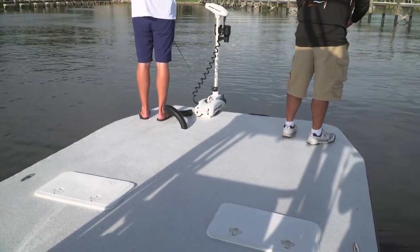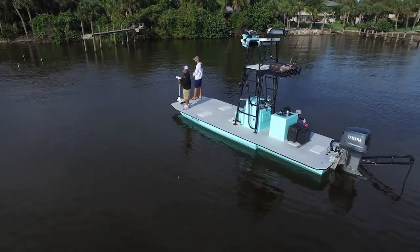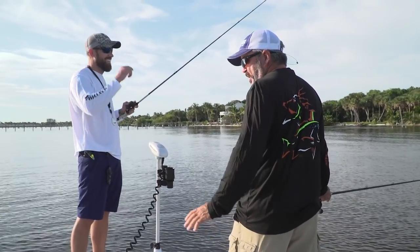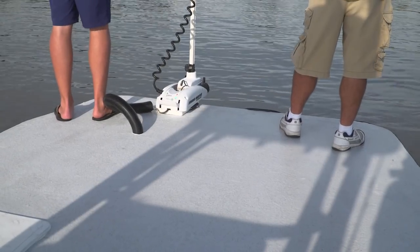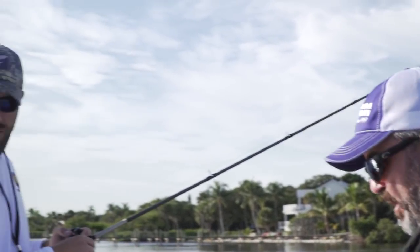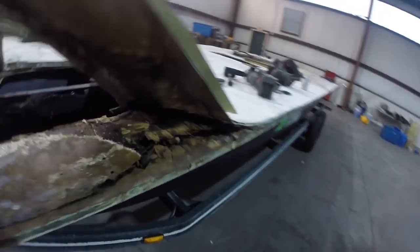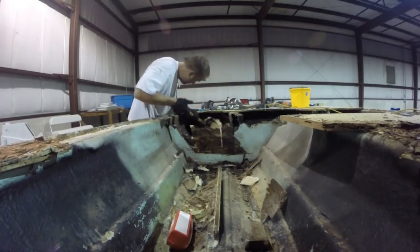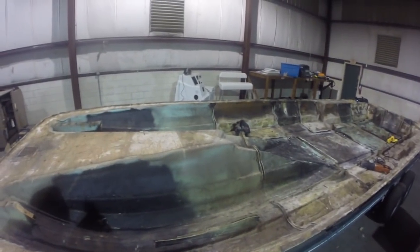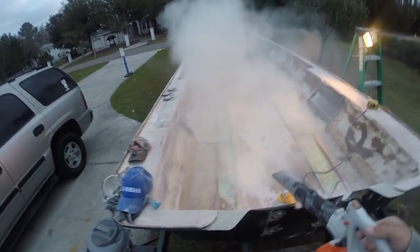Mitch and I got to the fishing spot. I went up to the foredeck and one of the first things I noticed was how much room there was. This boat has got so much real estate, which is perfect for Mitch — he's a big guy. Mitch and his wife and kids can run around on this boat for days without bumping into each other. When I bought the hull, it was just rotted — there was foam, wet foam, it was heavy, and it just wasn't structurally okay. I got it all the way down to the quarter-inch fiberglass hull that was completely bare. I spent two and a half weeks on a grinder trying to get this thing clean.